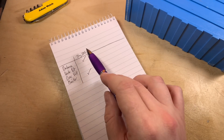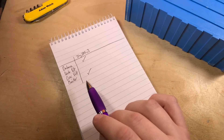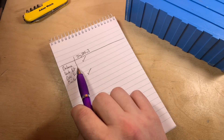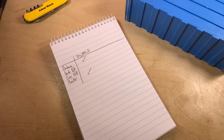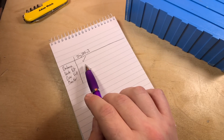Unfortunately, over- and under-voltage protection wasn't really a feature in DIY BMS version 3. Each cell monitor would protect the cell from over-voltage, but there wasn't an overall over-voltage protection — no way of switching off the charging if the whole pack's going over-voltage, or under-voltage. I do have that feature built into my solar charge controller, which stops charging if the whole pack exceeds a set parameter, and also turns off loads via the load output when cells go under-voltage. So although not a feature of the DIY BMS, I was getting those features from another device.